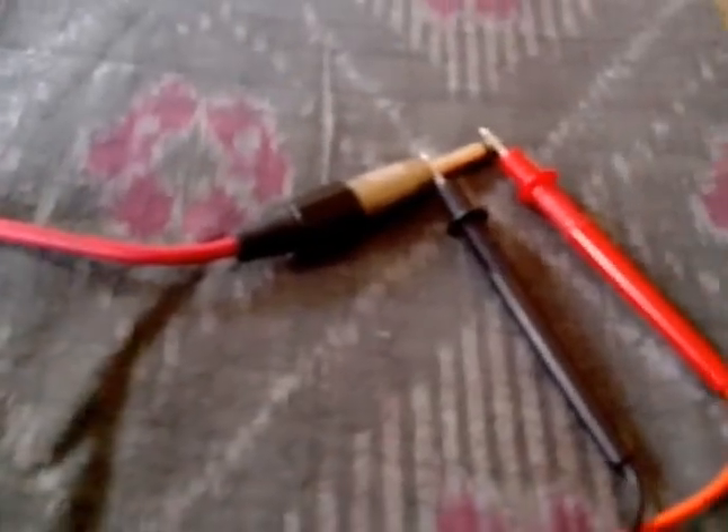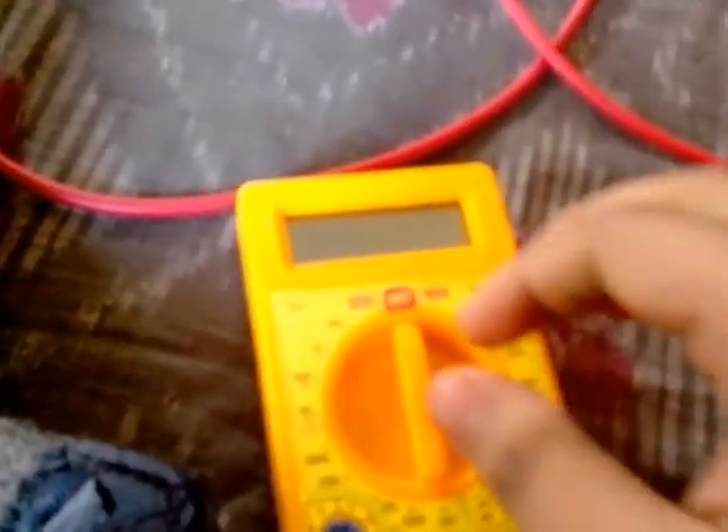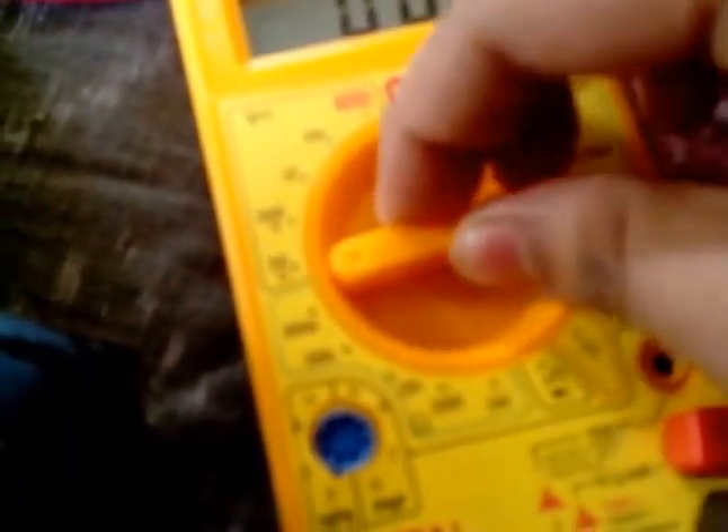Another thing you'll need is a lead cable. One of the leads is already inserted into the jack. Now let me tell you how to set the multimeter accordingly. The DC resistance of a guitar pickup is usually in the range of 20k ohms, so I'll set it to the 20k mark to measure the DC resistance.